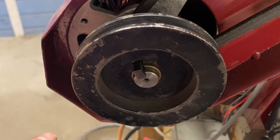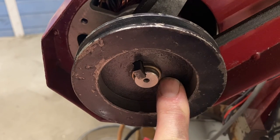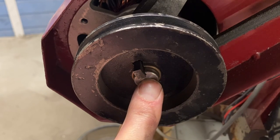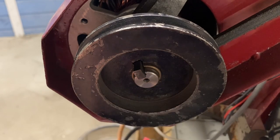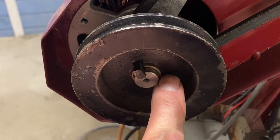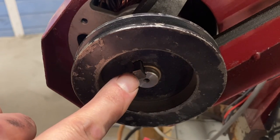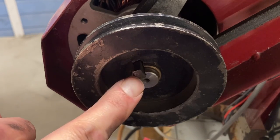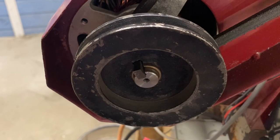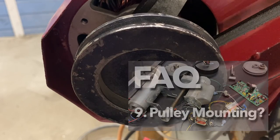Right now I'm showing you the end of the pulley. The ID that fit over the shaft was actually larger than the OD of my treadmill motor shaft. The solution was simple: I created a sleeve — a bronze bushing that goes around the shaft to take up the extra diameter. Then I machined an extra-tall key and cut a groove in the bushing. This is a technique I cover in one of my frequently asked question videos on mounting up pulleys.